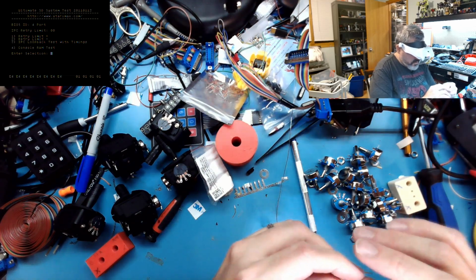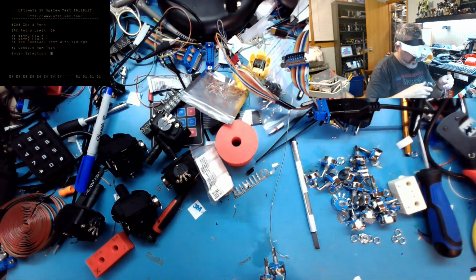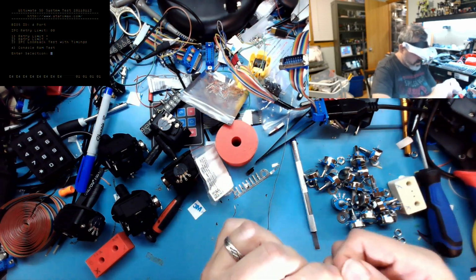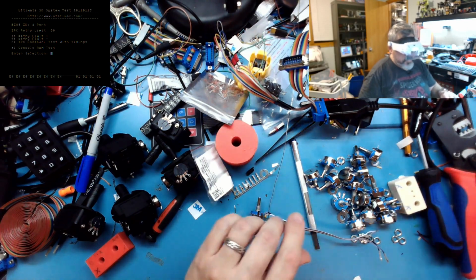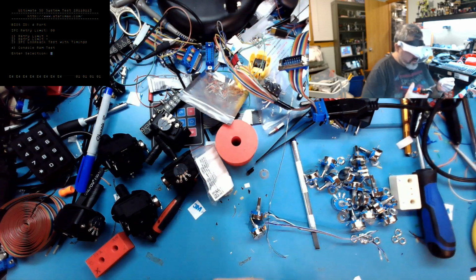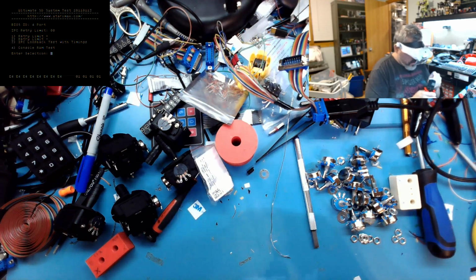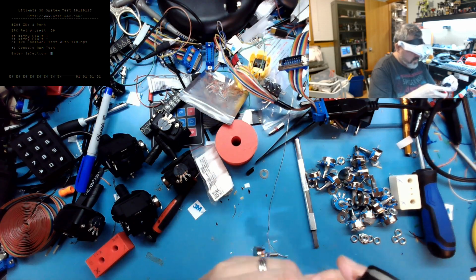And this is the one that's a little different because I'm putting both into one. Let's trim these back a little bit further. You put two into one connector, because I'm twisting two wires into it. I've purposely stripped it further back so it's not going to grab the insulation on this one. I just want to combine the VCCs, the voltage, the 4.2 volts the 5200 kicks out for the controller. Odd voltage. Yeah, it's 4.2 volts. Crimp that. Here we go.